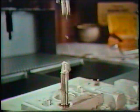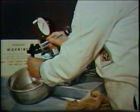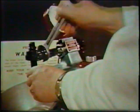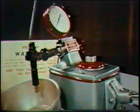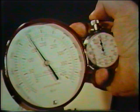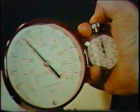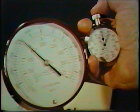Now to test and set the atomizer. Remember, when attaching the atomizer to the test pump, to position it in such a way that the spray cannot injure the operator — the skin is easily punctured or the eyes damaged by the high pressure. After ensuring that the system is completely free of air, increase the injection pressure by screwing down the spring cap nut. After setting the pressure at slightly over 150 atmospheres, check for back leakage by timing the pressure drop. On this and short stem nozzles, a drop of 50 atmospheres in not less than six seconds proves that all pressure faces are serviceable. This setting is for back pressure testing only and has no bearing on the ultimate setting required for a particular engine application.